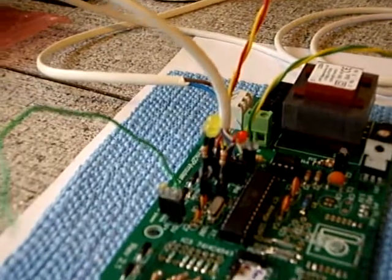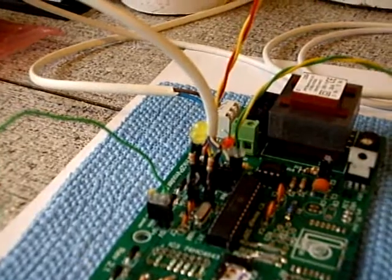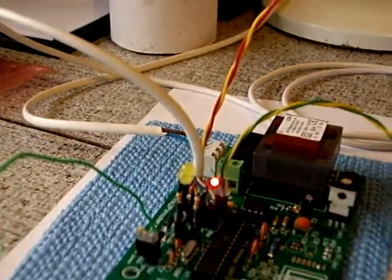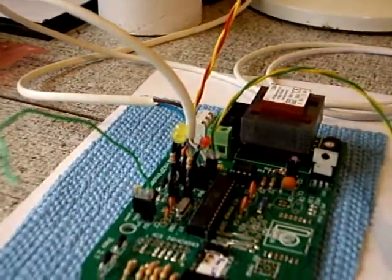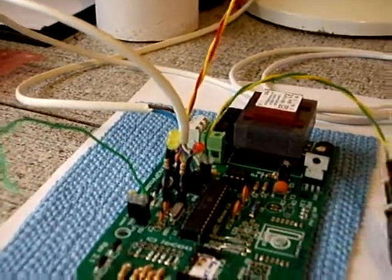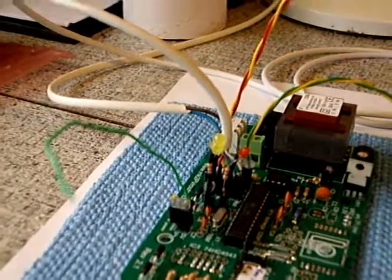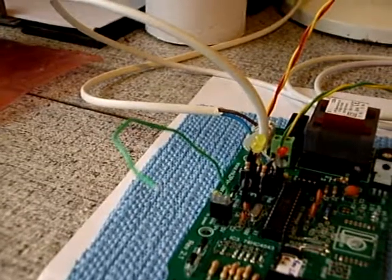It's a very easy way of calibrating CT2 against CT1, and by an associated program CT1 can be very easily calibrated against the digital meter of the house. By means of these two programs, you can calibrate Mark II router hardware very straightforwardly without really any equipment other than just a couple of LEDs and bits and pieces — all very straightforward and a lot more satisfactory than simply putting a load that's presumed to have a certain value and hoping that's what it's pulling.